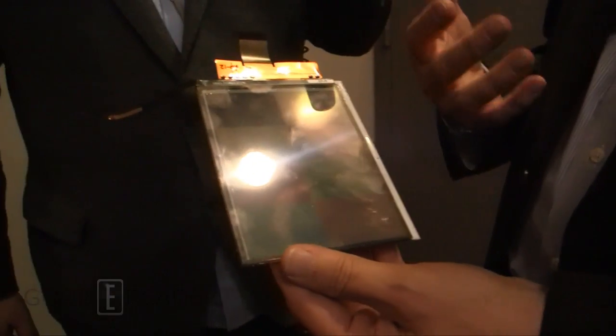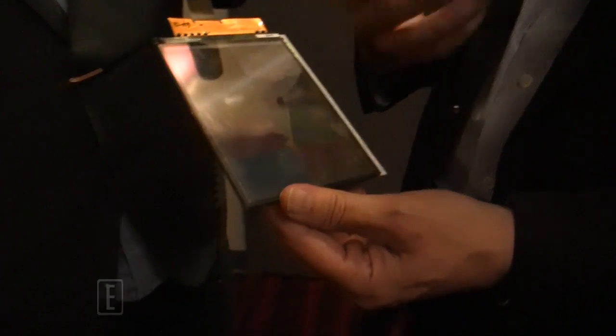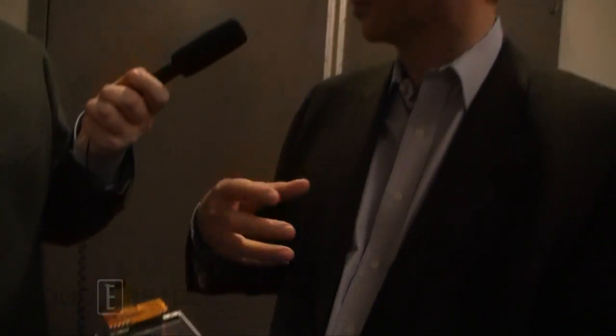With the front-light technology, the whites pop more on this version than they did on the original E-Ink Triton. How does that work with text being higher contrast, easily readable, with whites that pop more? It works exactly the way our technology has always worked — our technology has always gotten brighter as you went outside into sunlight because the amount of light energy was greater. By putting a front-light on it, we increase the amount of light energy shining on top of the surface compared to the ambient lighting in the room, which causes the white to become whiter, the colors richer, and increases the contrast of the display.